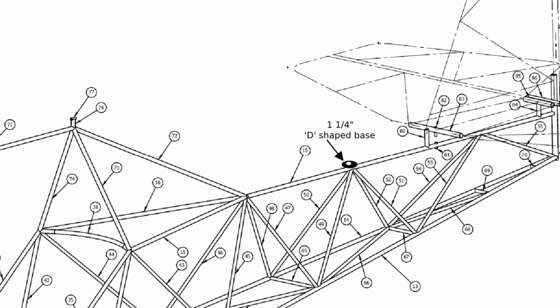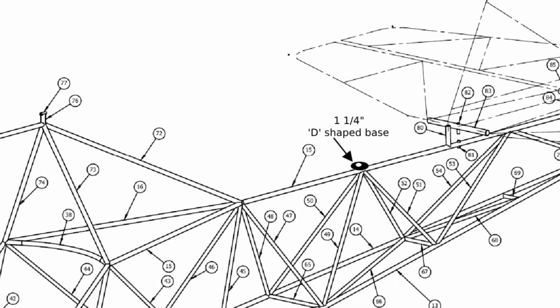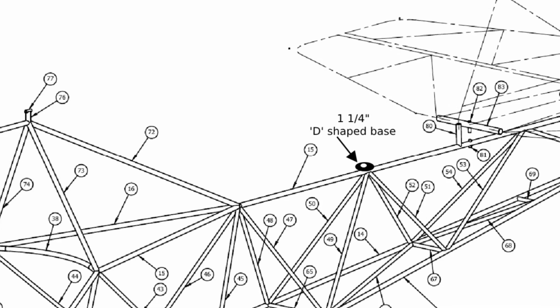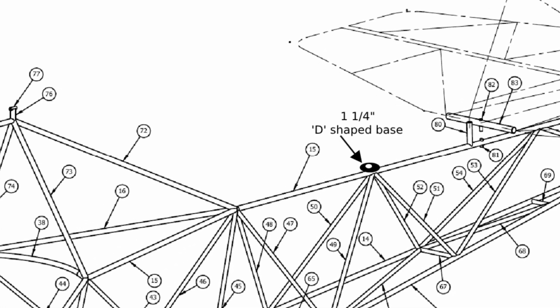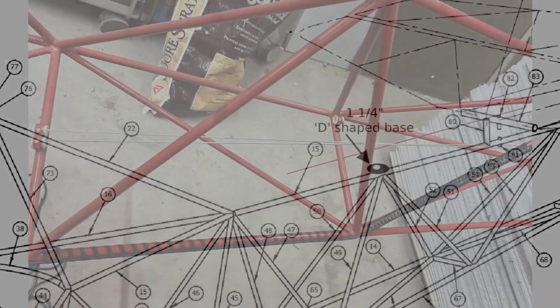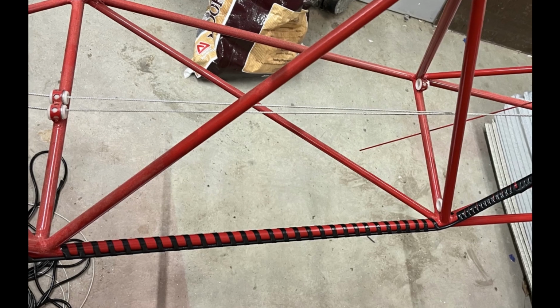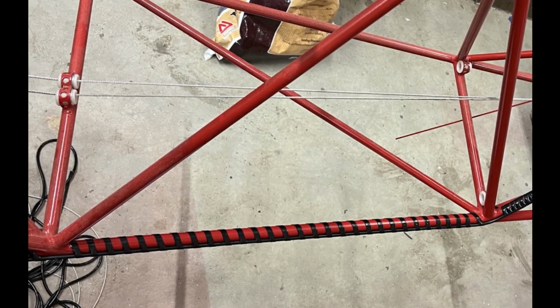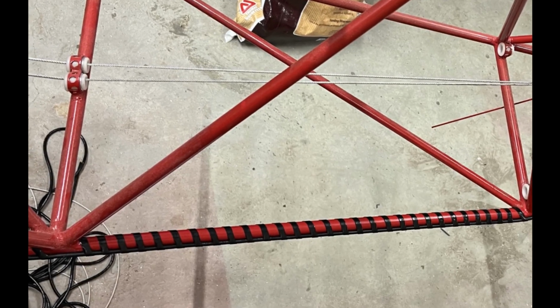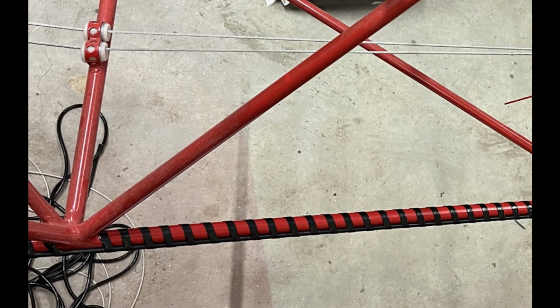On our airframe, we really need to weld a tab horizontally to the top longeron. This will be our mounting and the start of the grounding plane of our antenna. We need to route the antenna's cable to the perfect location for where we're going to mount the handheld radio. We can cut off the excess cable and strip the wires a few inches or so for now.